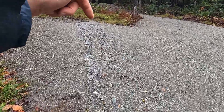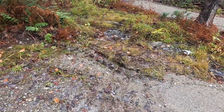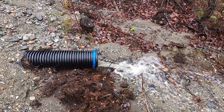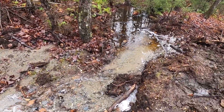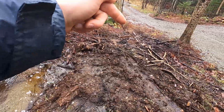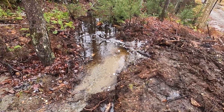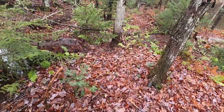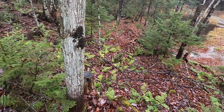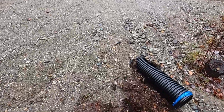You can see a bit of washout right here, but right now there's not a lot of water running, and it seems to be working okay. On the outlet end I don't really have a dissipator pad, but it's sort of making its own — washing away the fines. I did have a little retention area. The water was actually going down the other way, causing more problems with that road, so I dammed it up with native material and now it runs off to the left, going directly into the pond rather than down my roads. So far, no indication of any bypass or leakage.